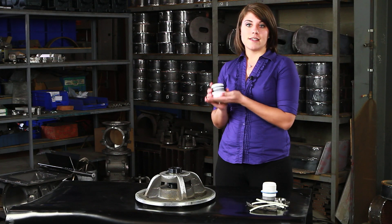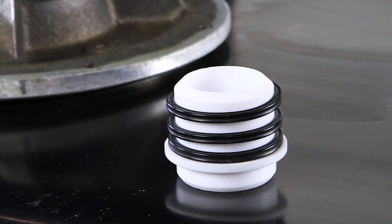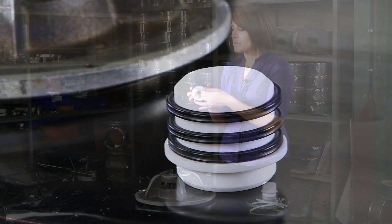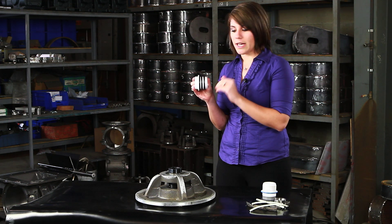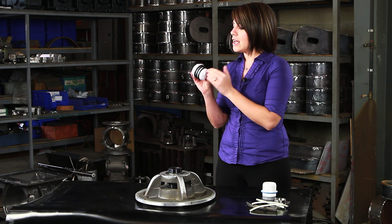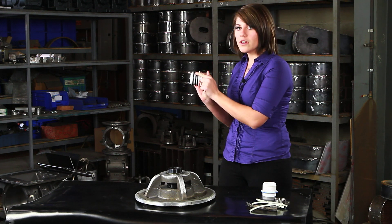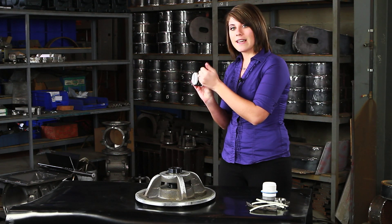The reason this is a superior shaft seal assembly is because it is precision machined on our CNC machines. It is press fit onto the shaft — material cannot leak out. With these three quadrings we groove three grooves into the end plate. The quadrings sit perfectly into those grooves, therefore the material has to get through each of those quadrings, each of those grooves, each of the grooves in the cast iron end plate.